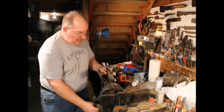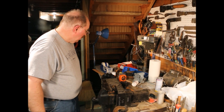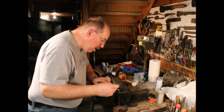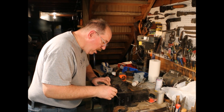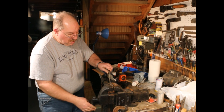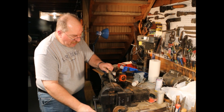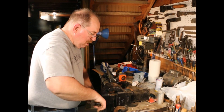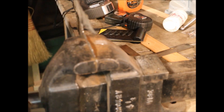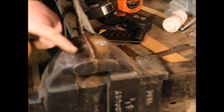Now I want to cut a section out of this piece of sheet metal. I have it flattened so that I'm reasonably certain I'm going to be cutting a square cut. I'm going to strike a line across it and set that line down even with the base of the jaw. You can snug it up a little bit and wobble it back and forth until it lines up where you want. Now I have the steel snugly in the jaws. I hold the chisel bevel up, set it edge on, and set it to the sheet metal.